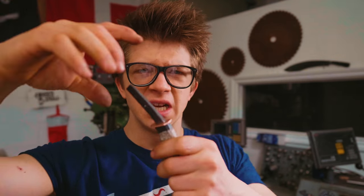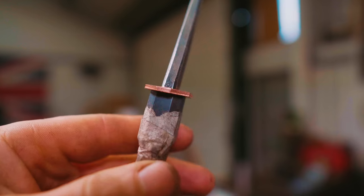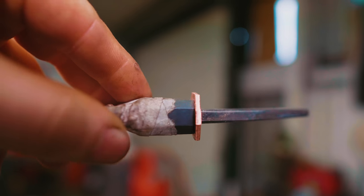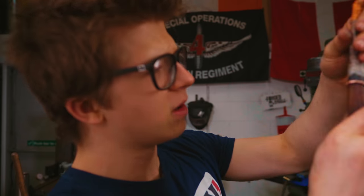I cut out another 2 millimeter spacer and I got it all shaped up, pretty much ready to glue up. You know, this would have required some shaving of the handle material to get it all set. And then I looked at it. Would you believe it was as simple as looking at it and checking? It's all it takes, looking at it and checking. I would have spotted this earlier. And I noticed that my bolster is no longer square to the blade. It is tipped at an angle. That's ridiculous. That is absolutely terrible. And it's not something that can stand, because this then means that once this is finally assembled, you're gonna be looking at it as you're using it and you're gonna see that everything is twisted that way.